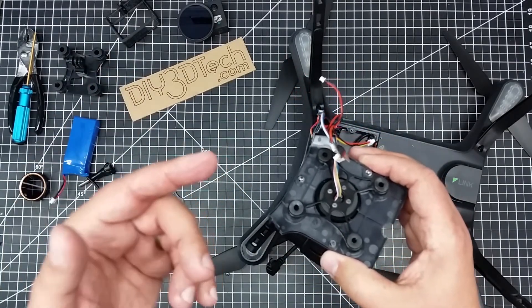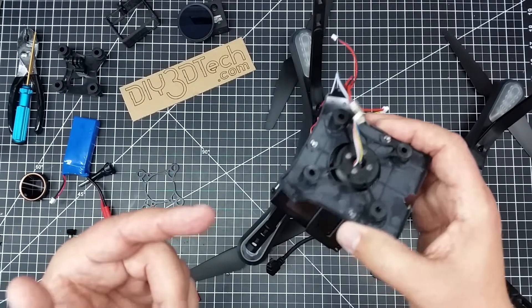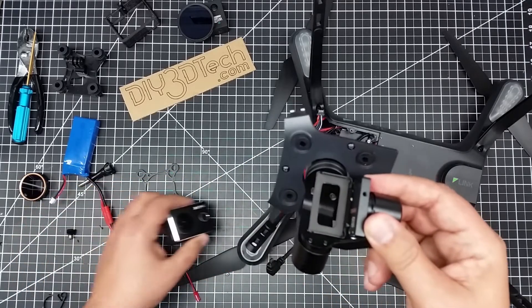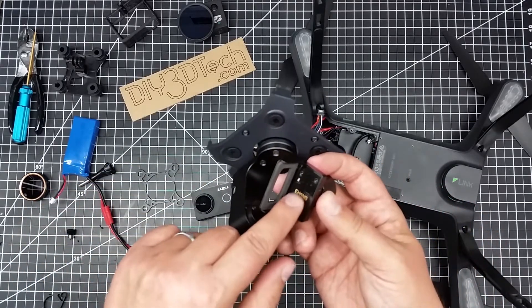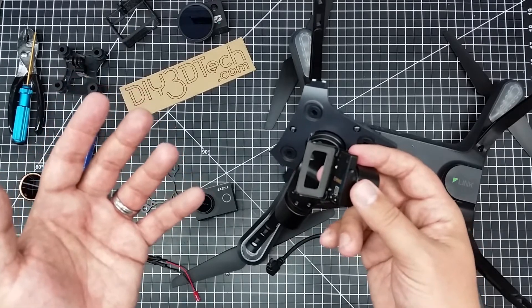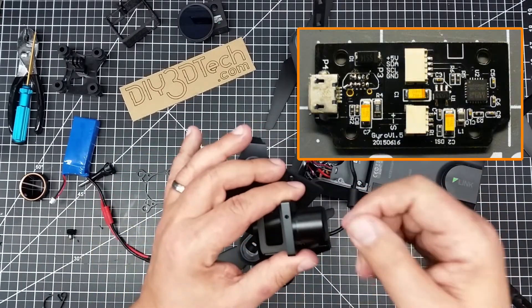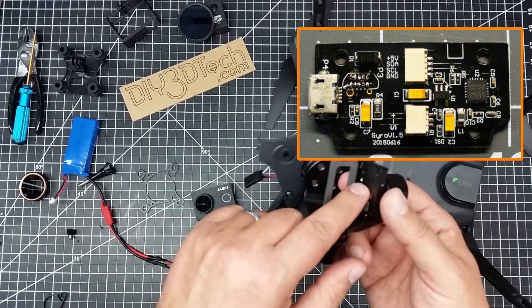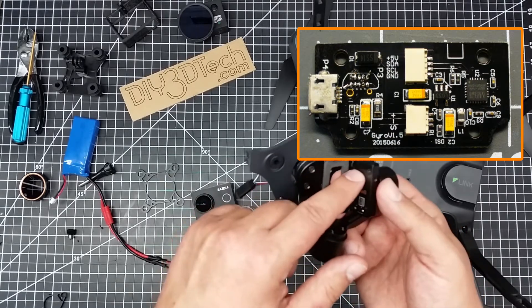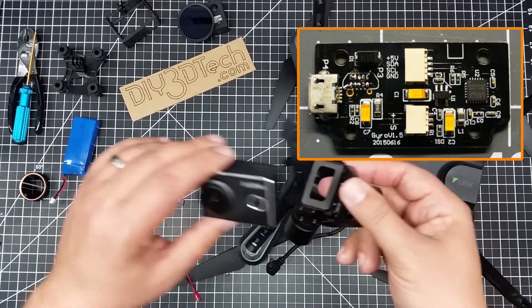It works perfectly, and you have this little controller board. I'm going to talk more about the electronics in another episode. In this episode I simply want to introduce what I'm doing and share it with you. The gimbal comes with, oddly enough, a mini USB port to plug into the GoPro. This is worthless to me because I don't plan on using a GoPro, so I desoldered it. I'll do an overlay so you can see the circuit board — it has pinouts for the mini USB, and also housed in this board are the accelerometers which control positioning.